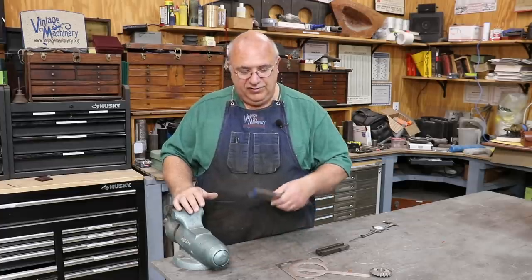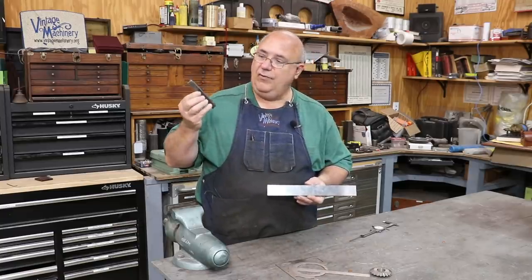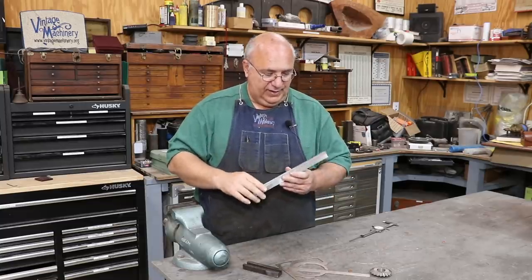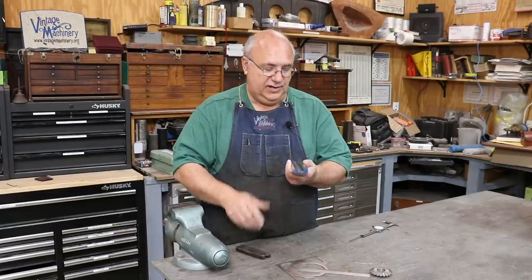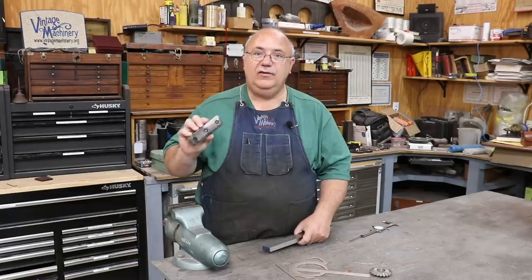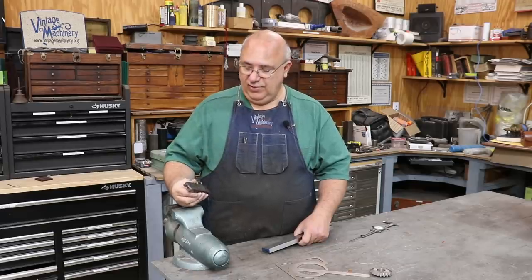What I've already done is purchased a blank of tool steel — some A2 tool steel, which I can harden to get to the same hardness as the original. This tested at about Rockwell 45 to 50, around Rockwell 50. I've already come in and milled the slot in the back that's going to fit up on there. We did that over on the horizontal milling machine in a previous video. Today, I want to get the serrations put into the vise jaw over on the horizontal milling machine as well.